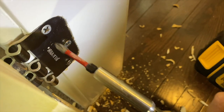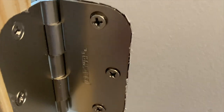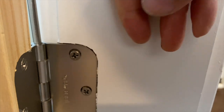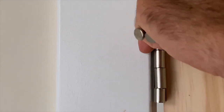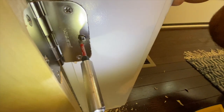I'm loosening the screws right there. The door was very close, but not quite perfect. So if you loosen one hinge — probably the one that doesn't fit — put the pin in like I did there, and then fit your pins in the other hinges. Once you get all your pins in, go ahead and tighten that hinge back up, and then everything should work fine.